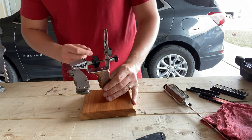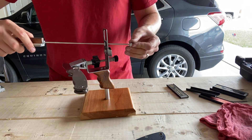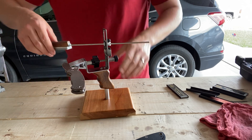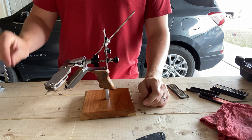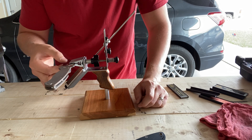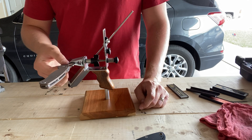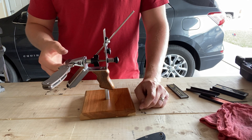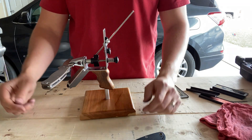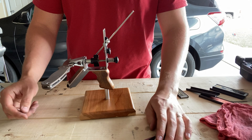If your skill is very high, you can do very light pressure and match that angle perfectly — you can get some sick results. Just want to demonstrate what you can do with those very light edge trailing strokes. In all seriousness, there is probably a little bit of burr that gets kind of drawn out on there, especially on a stone this aggressive. But even with having that little bit of burr and getting a quite clean apex like that, you can get some sick results. I'm going to keep sharpening these knives — stay tuned for some testing with them. Have a good one!